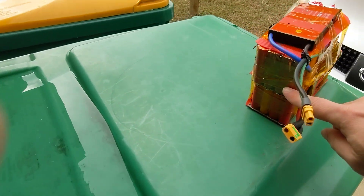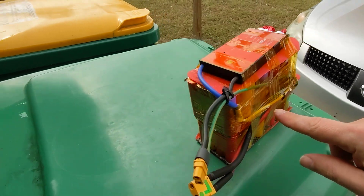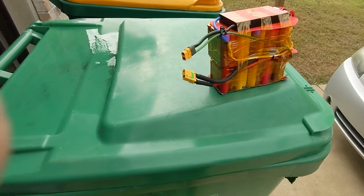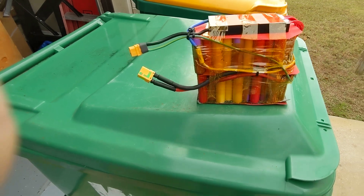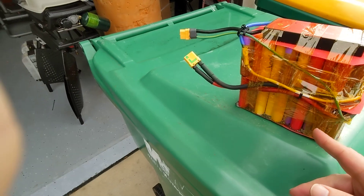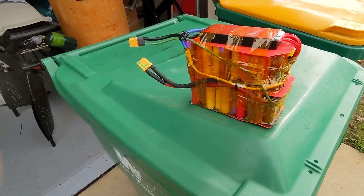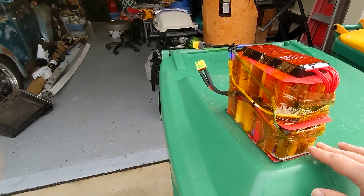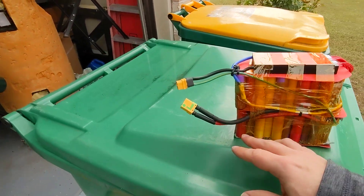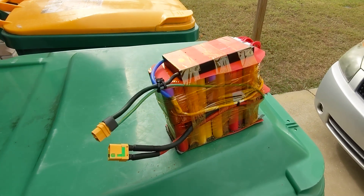While I have four of them in parallel, that gives me the ability to handle a little bit more amperage than a single one, because they're sharing the load amongst all four. I actually need to get different cells. So I ordered some new cells and I'm doing it a little differently. This pack is 80 cells — four in parallel, 20 in series — making a 72-volt battery.